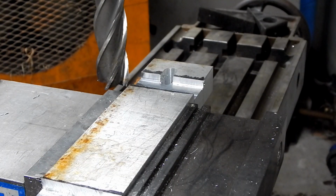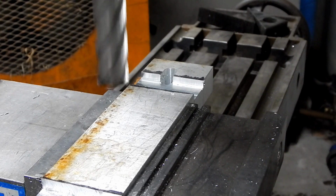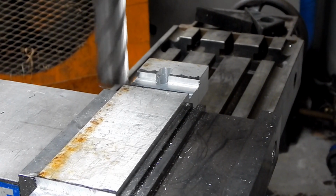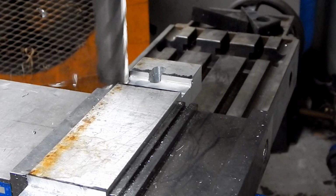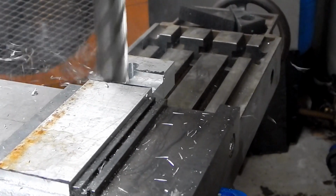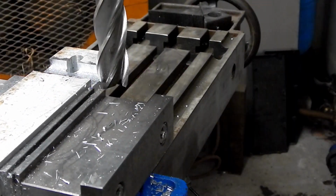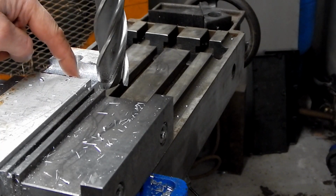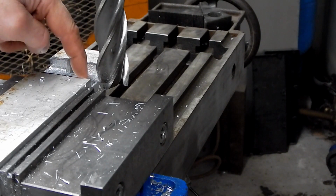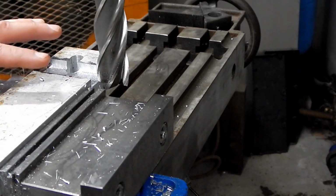All right, I'm going to see if I can crank the handle faster and increase the feed rate on this pass. Well, that was better. But that's because this slot was deeper already, I think. So I just took a smaller depth of cut on this side. But now I should be able to measure these and the depth should match.